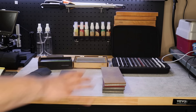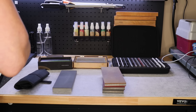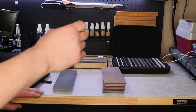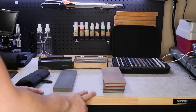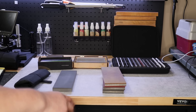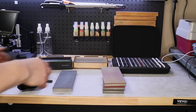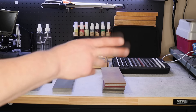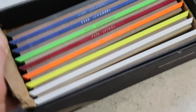You can get more stones than competitors — all other companies are basically a six-stone setup, but these guys have seven. You can get two more on top for nine total, because they have extra super fine stones — a 5,000, possibly a 10,000, and a 15,000 grit. The full grit range includes 80, 160, 240, 325, 650, 1500, 3000, 5000, and 15,000.